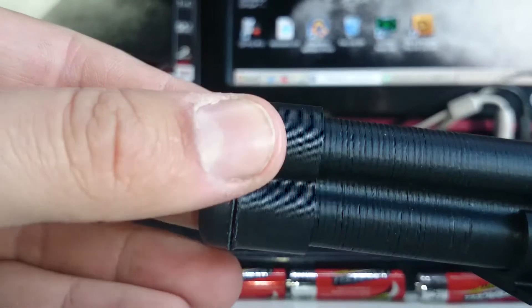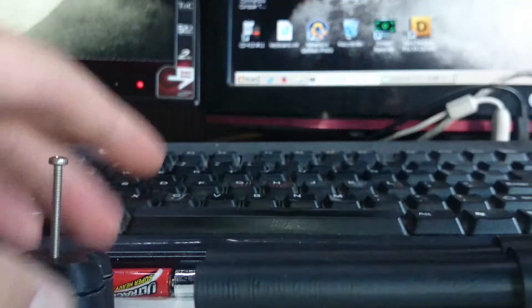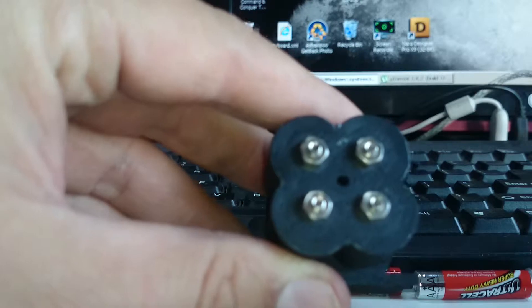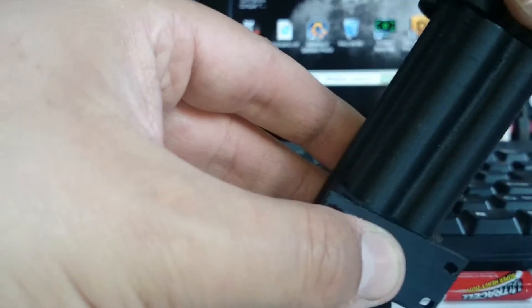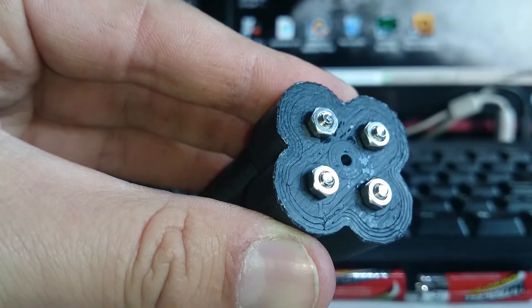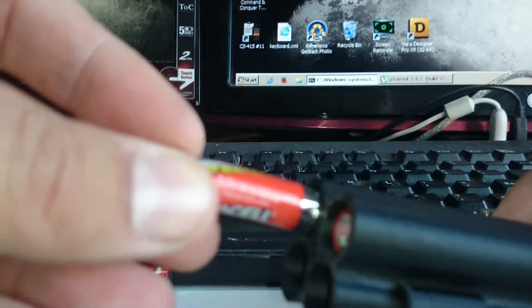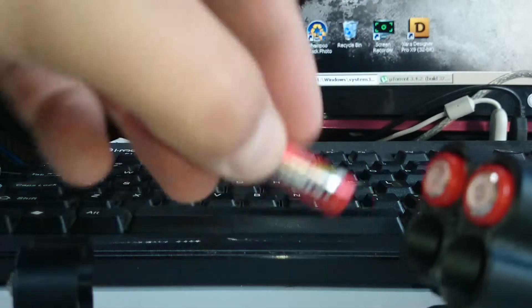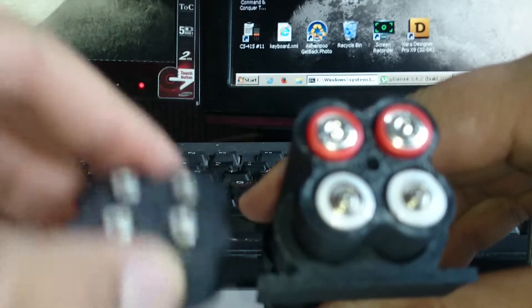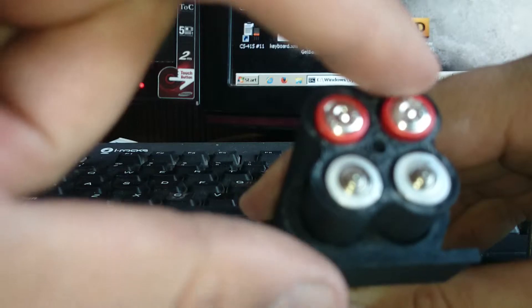The notch allows a thin-gauge cable to come out — small figure-eight speaker wire is normally what I use. As for the wiring, I normally go top to bottom and top to bottom on each barrel, which saves having to cross over cables. At the other end, you run one wire diagonally from either end to pick up a positive and a negative. When you pack your cells in, you pack two in the same way at the top, and at the bottom you pack the positive outwards, so you end up with your terminals running from one cell to the next across the barrels.